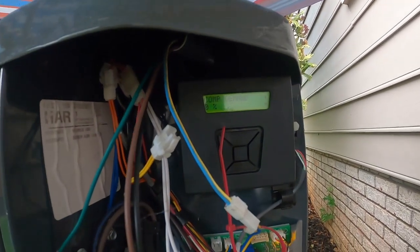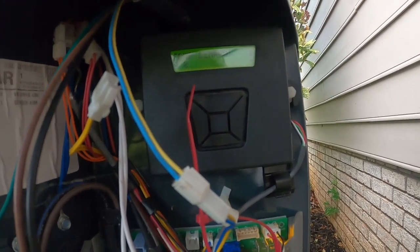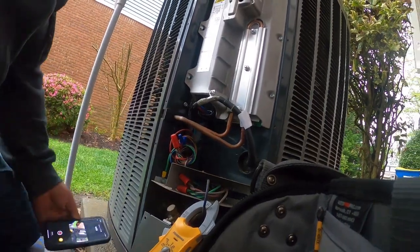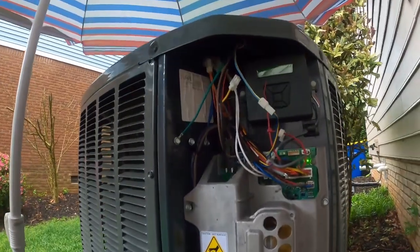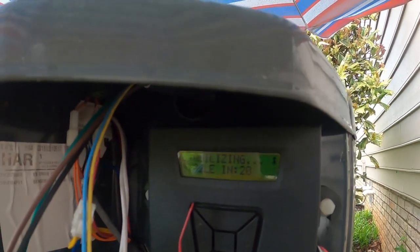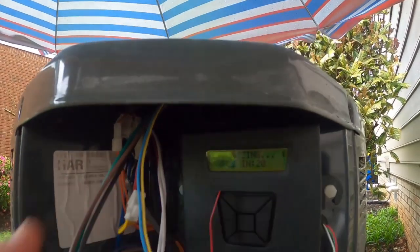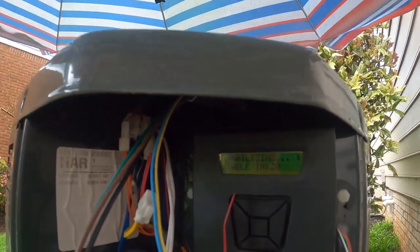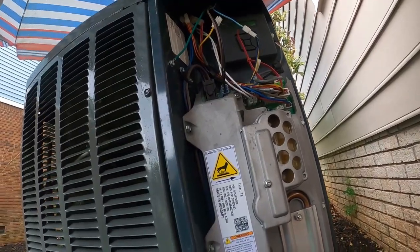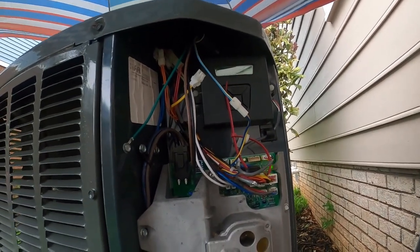Let me see if it will let me turn this thing on in check charge mode from the thermostat. I have put it in check charge mode. When you go into charge mode to get this thing to run, it'll stabilize in about 20 minutes. Typically during startup you'll let it go through this mode — it runs at 100%. Once stabilized through the 20 minutes, then you'll set your charge superheat and sub-cooling.